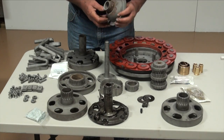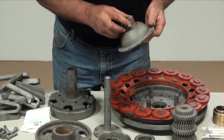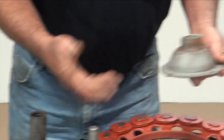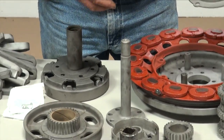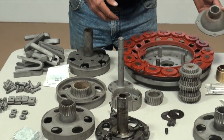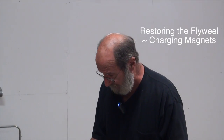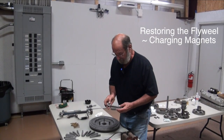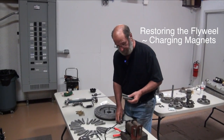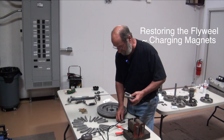The fourth main is the piece that goes onto the drive plate, and we've poured a fourth main and we'll bore it out to size, kind of after we've finalized which of these components we're going to use. So first off, I'm going to take our magnets and identify north-south pole and put a mark on it, because that's what I'll use to put them in the right relationship when we go to charge them.